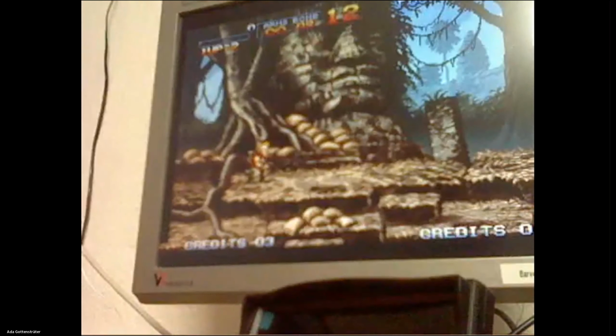However, on the HDMI thing, the limit is a lower limit. In the general case with most normal HDMI devices, you can actually add as much blanking as you want to the image. They do not care. So you can increase your clock frequency as much as you want by just adding blanking to the signal. This will, however, not work if you have something like an HDMI to VGA adapter. Then it will horribly die because of all the extra blanking that it doesn't know what to do with. Well, it does know what to do with it, but it will.